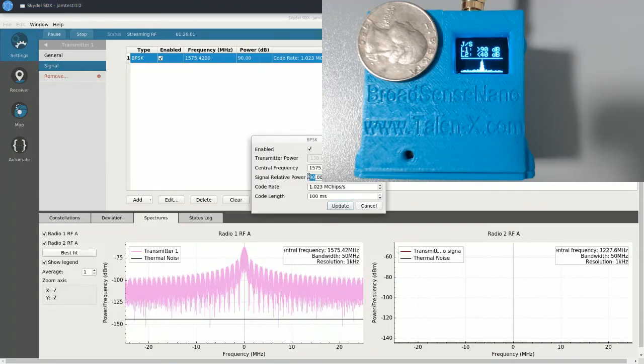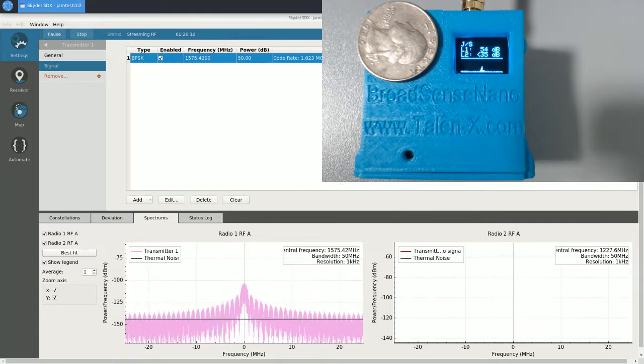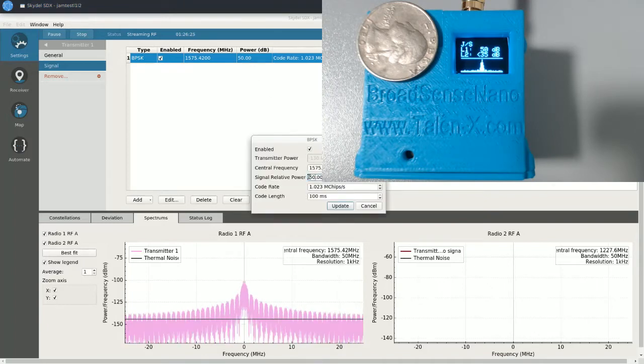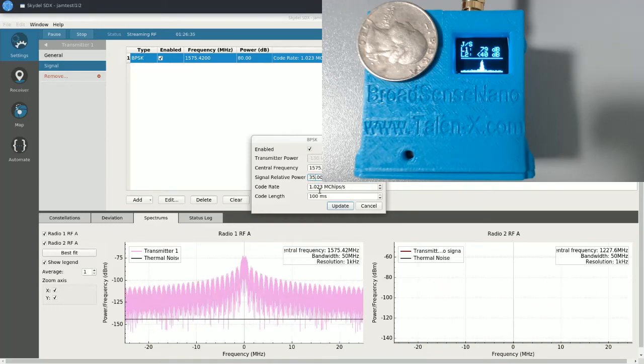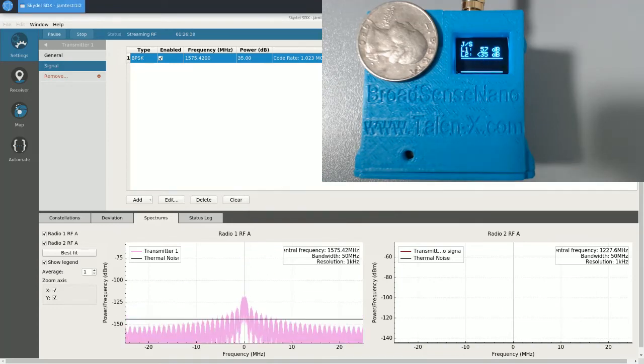Let's do some larger jumps. Instead of going up linearly, we'll try bouncing around a little bit to make sure the sensor correctly gets to the J to S level. I'm going to go back down to 50 dB. You'll notice it takes a few more seconds to settle down from the high power level, but fairly quickly the sensor does settle back at 49 dB J to S. I'm going to try 80 dB — and very quickly we go up to 79 J to S. And let's try a really low power jammer at 35 dB. You can see it takes a few more seconds to drop down so low from a high power jammer, and now it's indicating that the J to S is less than 35 dB.